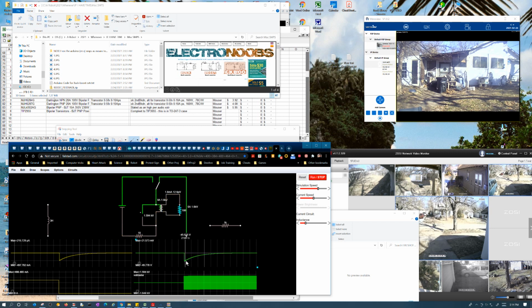So we can see that on our resistor, just like before, we're actually getting about 50 volts negative, which is to be expected. Even though this is only 5 volts, since the ratios between the charge resistance and the discharge resistance are off, it's a 10-to-1 ratio, the voltage here is 10 times higher, because it's trying to maintain this 500 milliamp current to start with. Because again, the important thing is how much energy it has in it and what kind of current it's going to try to maintain.